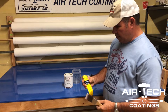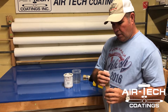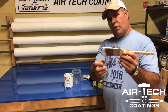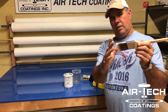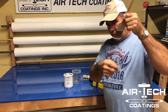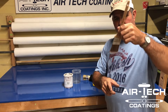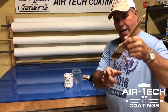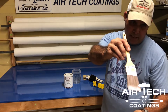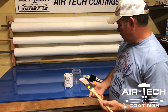One I like — I'm not promoting this — is the Clear Cut at Lowe's. They do something to the edges that gives it a sharp line. I've grown accustomed to a little bit of an angle cut rather than straight, because it comes to an angle and I can see right where I'm putting my glue up to my line. I don't want a two-inch brush for two-inch tape because then you're trying to control both lines. With an inch-and-a-half brush, you can come down one side, come right back down the other, and you've got the glue right to your line.